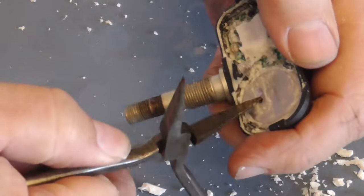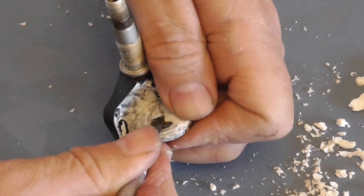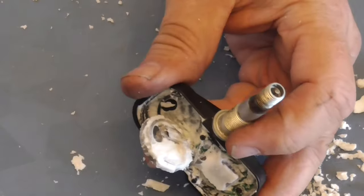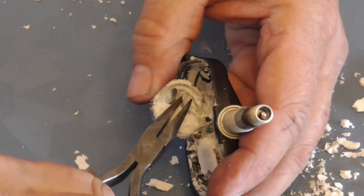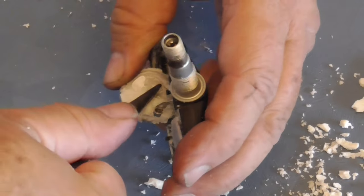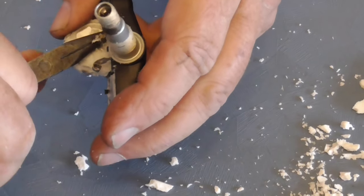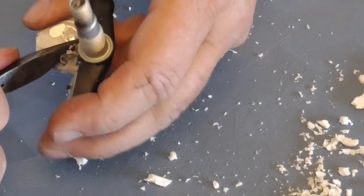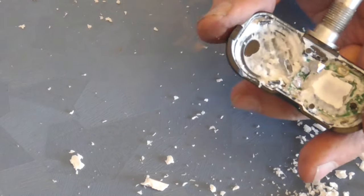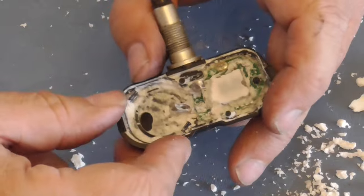So there were four tiny spot welds I heard pop. Let's see if I can do this side now. I've got it lifting; I'm going to have to rotate it. Twist and roll. And there's the battery off and out the way, so there's no power going into the unit anymore. When I'm digging underneath I can't short circuit it — that's probably important, isn't it?